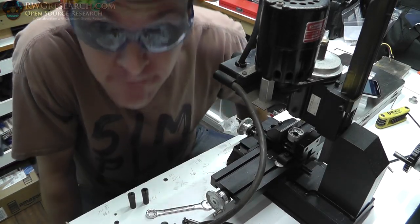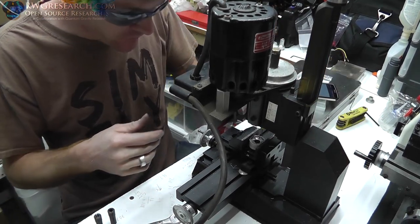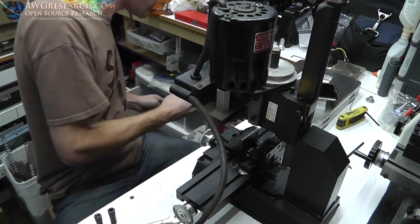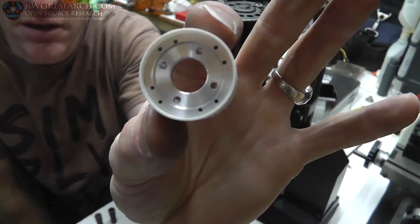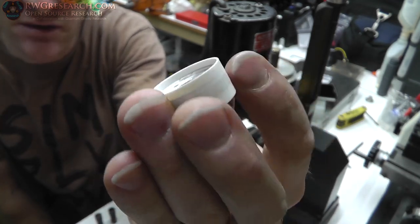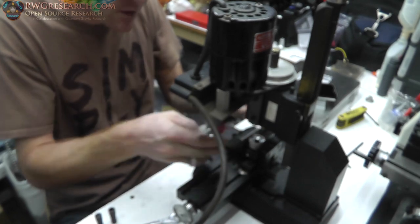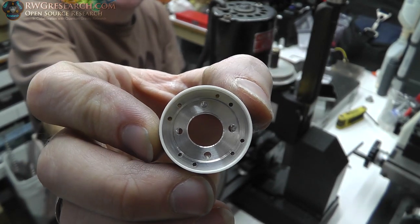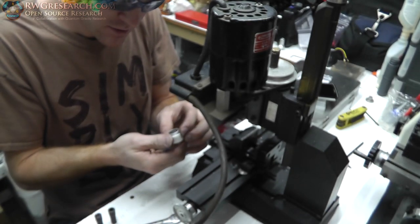It is now three o'clock in the morning. I just couldn't stop. This is the first time I got to use this mini mill and so I used it. So far it's working amazing. I took a piece of PVC pipe and machined it to fit those two pieces together so it would hold everything perfectly centered in all directions, and then I just clamped that in my mini mill and went ahead and milled and drilled some holes. All the holes are slightly different and kind of weird — the ones that hold the motor are correct and good. All the other ones are just pre-drilled holes and then I'm going to find some really small screws and hand finish drilling these.